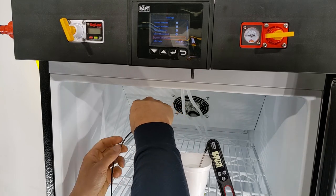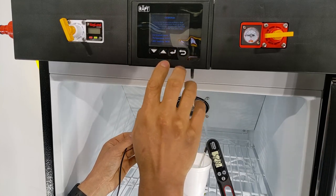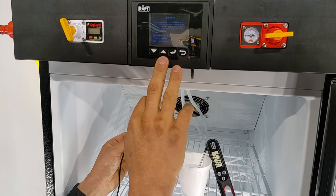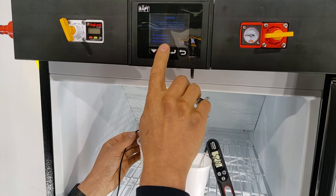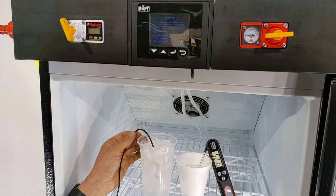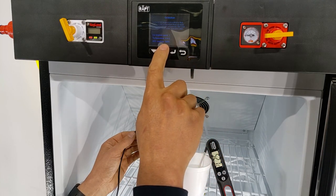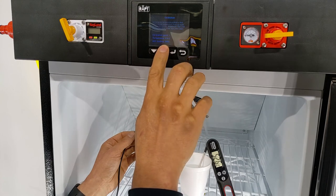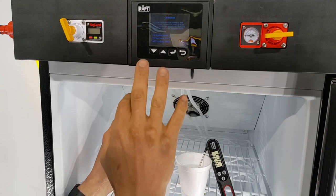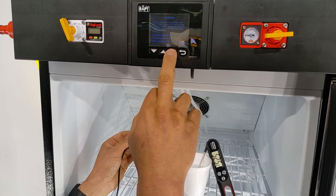You might have to support the probe cable to make sure it stays in the middle. Once you go into calibration, you can see that it's zero. The ADC reading — the analog to digital converter reading — I want to make sure that's stabilized. It will always fluctuate a little bit; that's the raw reading coming off the ADC pin on the board. But once that stabilizes within a certain range — I can see it's between around 3,470-something and 3,490-something — you want to hit the enter button.